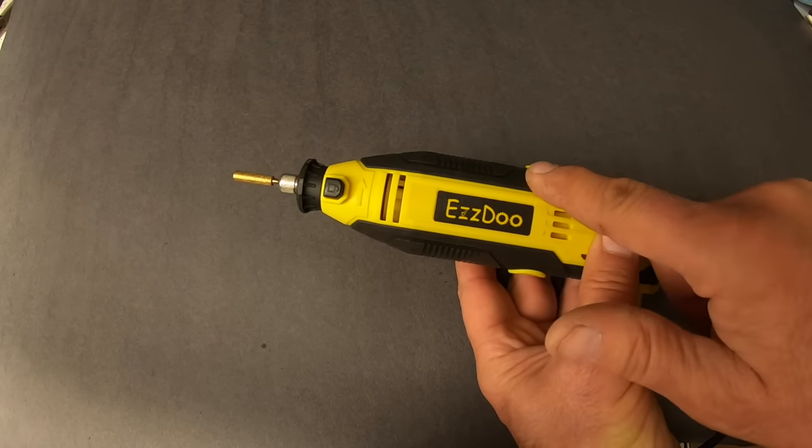So the next thing that I would do is I will take my depth gauge and slap that on here and give this tooth a feel. Yeah, that feels low. I just check these occasionally to make sure. See, the last time I sharpened this particular chain, I took the rakers down two strokes, and I can feel that the depth gauges, the rakers, some people call them, are still really good.